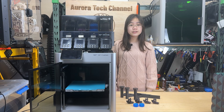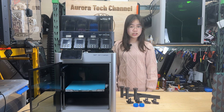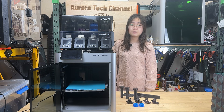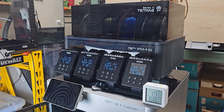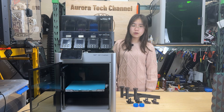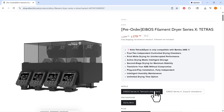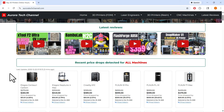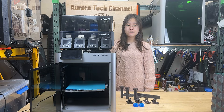In conclusion, the iBos AMS dryer does its job well. It's not just another AMS dryer — its thoughtful design, energy efficiency, and overall level of refinement help it stand out. I would say it is the best AMS dryer currently on the market. The price is not cheap, but if you are looking for a dryer for a first-generation AMS, this is the best option available. One thing to keep in mind is that when the printer is printing, you should use the second-stage drying mode, which reduces the temperature by 10 to 15 degrees. For long-term use, it's safer to use a lower temperature while printing to ensure you do not damage your AMS. If you're interested in the iBos dryer, I included the link in the description. Please also check out my website auroratechchannel.com, which tracks prices for major 3D printers, laser engravers, and CNC machines to help you find great deals. If you found this video helpful, please give it a like and consider subscribing. Thank you for watching, and I'll see you next time.